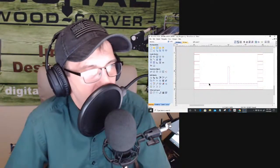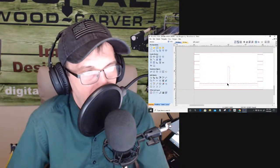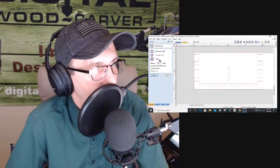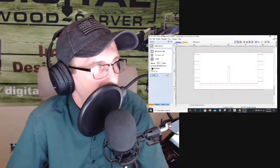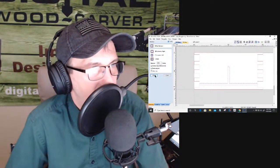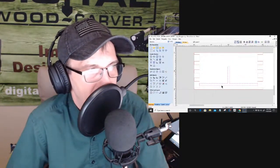Now, on this one, once again, we've got to size it up because it's too big to fit. My part is too big for this 0.1875 here. So we're going to offset it outward, right? Outward, 0.02, number still there. Love Vectric for keeping things in memory. So all I have to do is delete originals, check that off, and offset that outward. Okay, to get my part back up to size.